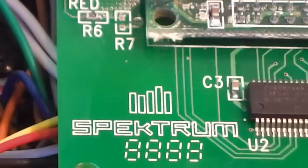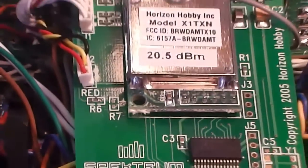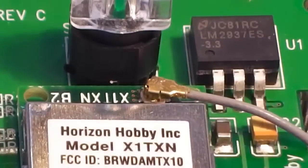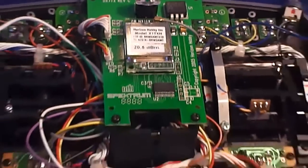I've got my motor hot glued into there so it's clear and free of the plastic. And those 2 wires go back into the controller, which is mounted underneath this board here on double-sided tape. And then all the other wires are actually underneath that board, which I showed in my other videos. And make sure you put your aerial back on your antenna wire. Just here. That grey one has to be in properly, otherwise if it flicks off you're going to be in trouble when you're flying out there and lose control. Okay, so that's pretty much the summary, and just be careful.